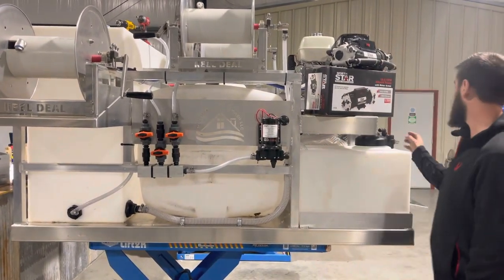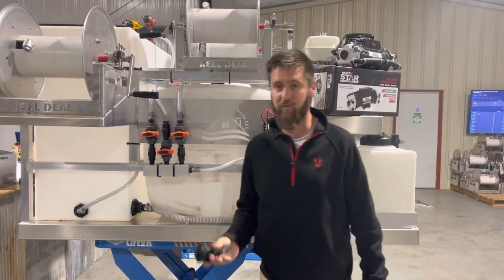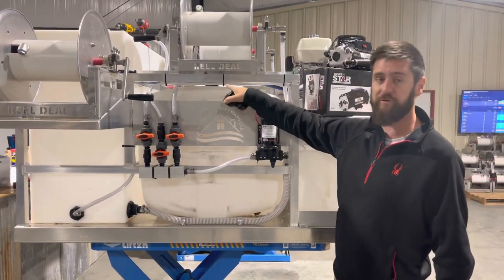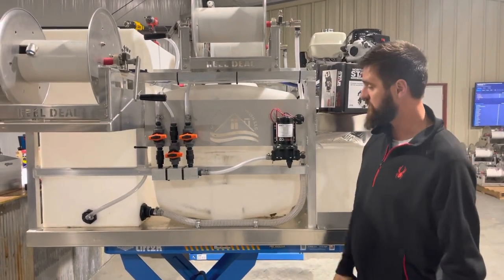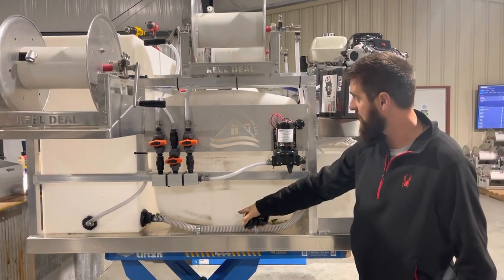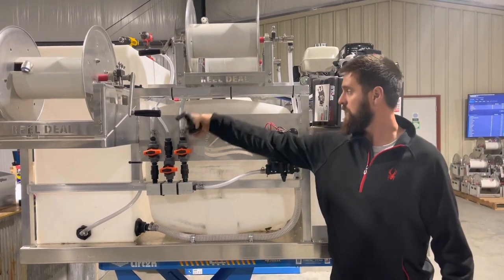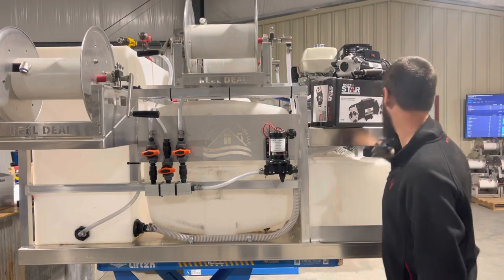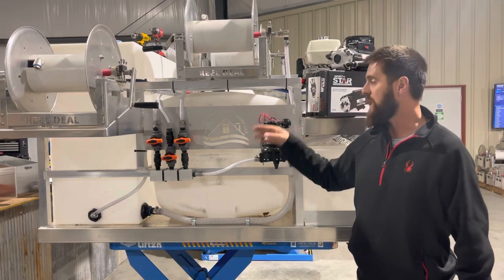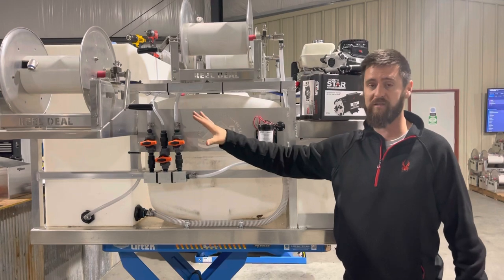When I say all the plumbing, I mean everything from the bulkhead — there's a three quarter inch bulkhead, which is much bigger than the half inch. The one going into the bleach tank, we use a drop stick because we don't want to poke any holes in the bottom of the bleach tank so it can't leak. We've got a PVC stick that goes down on the inside. All of that would need to be three quarter as well — three quarter bulkhead, three quarter hose, and a three quarter inch PVC line going down to the bottom. If you get all your plumbing on three quarters all the way through and your metering valves are one inch, your supply side is going to be pretty much perfectly set up.